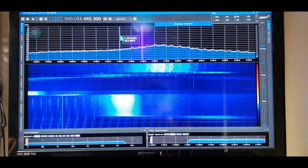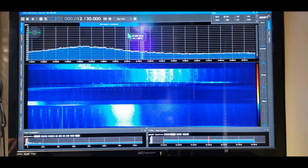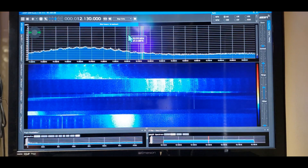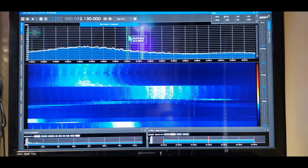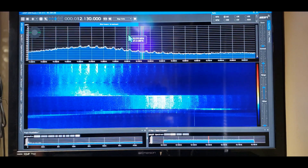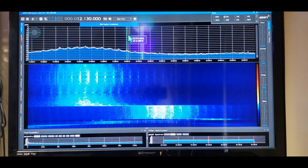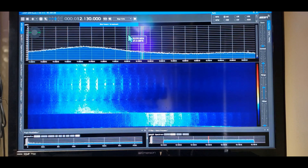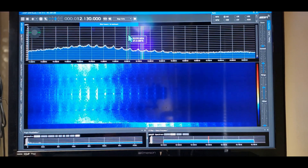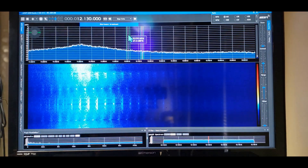This is what you do — just find out where your loop antenna is going to resonate. If you want, you could try buying two capacitors with different values and using them on the same loop; it will change where you can listen. You don't have to build a whole new loop — just change the pF capacitor.